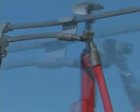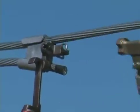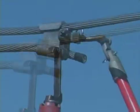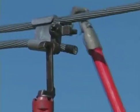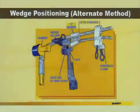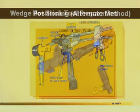Twist the shotgun stick to loosen the C holder from the C member. To position the wedge, place the wedge between the wires and into the wide end of the C member. Strike the wedge holder with the hammer to temporarily secure it in the C. Loosen the wedge holding bolt with the rubber end of the hammer and remove the wedge holder. The tap is now in position for firing. An alternate method for positioning the wedge eliminates the need to cut the end of the tap wire after applying the tap. Tape the end of the tap wire to prevent strands from opening and apply the piggyback clamp 8 to 12 inches from the end of the tap wire. Locate the C member 6 to 10 inches from the clamp, making sure the narrow end of the C is toward the clamp. Bend the end of the tap wire down and use the hammer to temporarily secure the wedge into the C member.